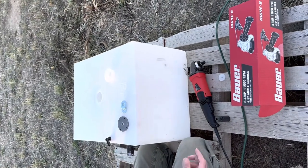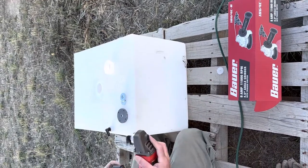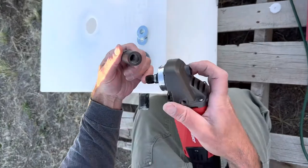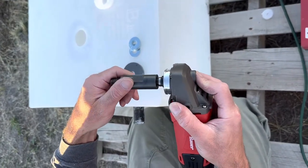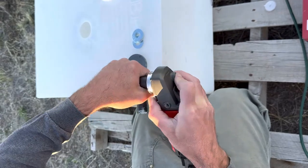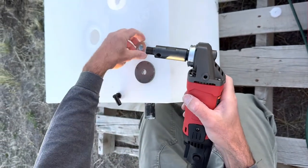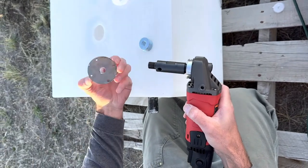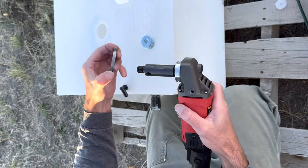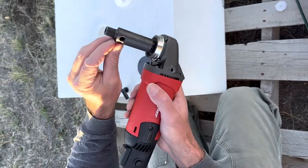I got an adapter and an extension — I bought this on eBay. I had to grind the inside of it out a little bit to get it to seat all the way down to the bottom of the angle grinder, which wasn't a big deal. Then I had this made and threaded it 5/8-11 thread, but it doesn't seat because of the shank — it's not threaded all the way to the bottom.